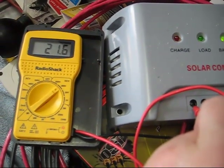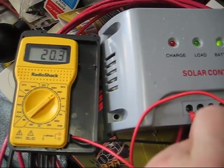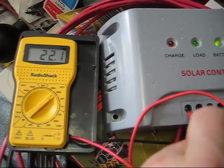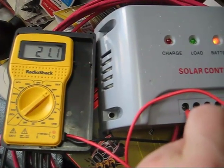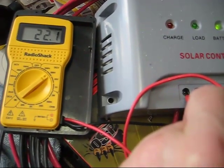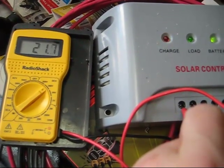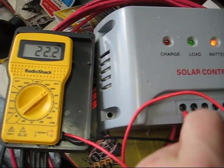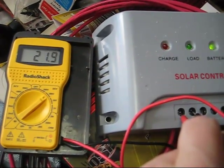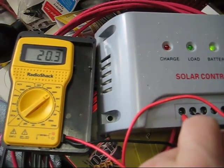Don't be too concerned about getting really heavy wire and gauge. 10 gauge for 60 feet looks like it's working great for me. You can see that the charger is working — it's at full MPPT mode, we're getting all the power coming in through the solar panels. 10 gauge wire bought at Home Depot was very inexpensive and it's doing a good job for me at 60 feet.